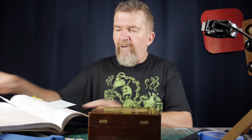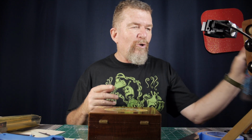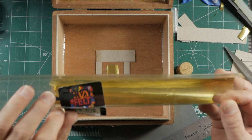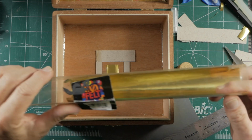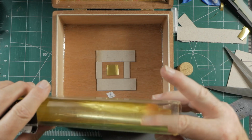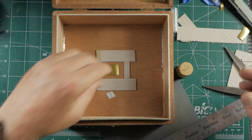So we're going to have to figure out how to make a pinhole that's about 1/3 of a millimeter. Okay, so I'm using this 2 mil, that's 0.002 inch thick, sheet brass. It comes in this roll. I bought this 20 years ago, and I'm getting low on the stock of it because all I've used it for basically is pinhole cameras.